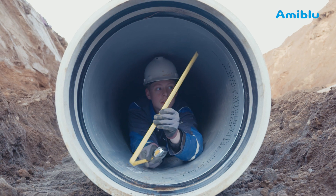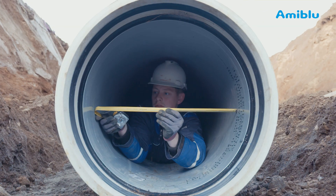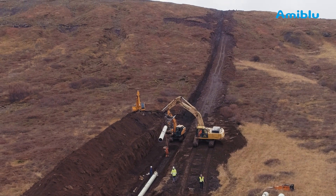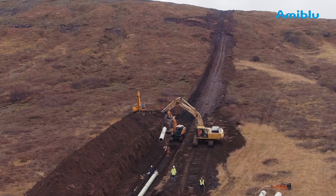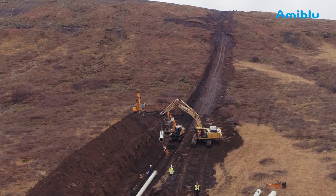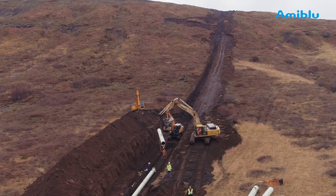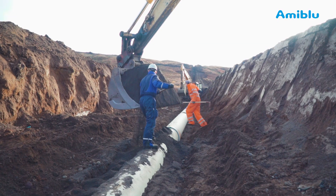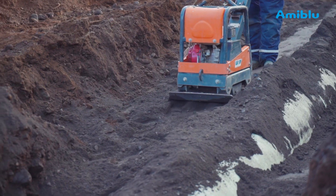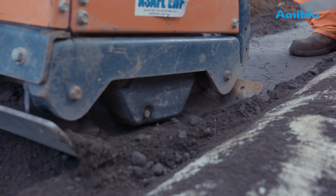Check for potential deflection. Be especially attentive as you start installing, so you become familiar with the nature of the soils to find an accurate compaction level. If pipes are deflected, adjust and align compaction levels on the sides and above the pipe. Add new soil layers in 100 to 300mm lifts until the pipe crown is covered, compacting between each new layer.